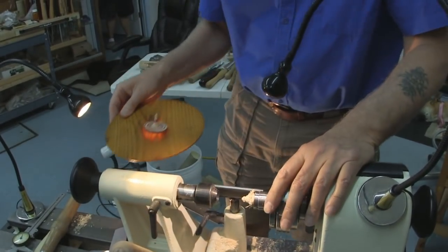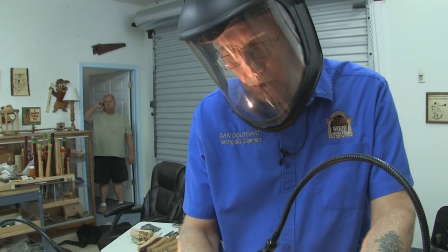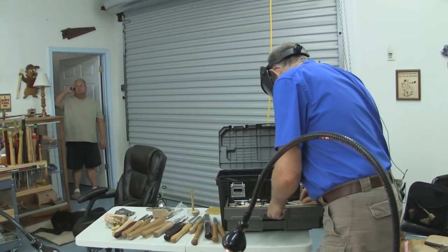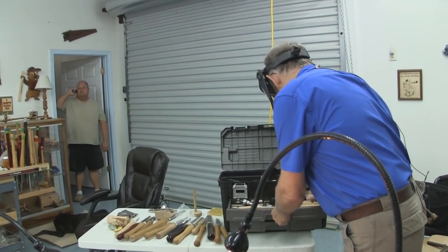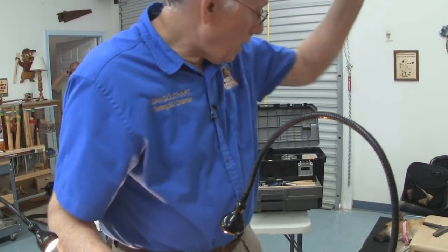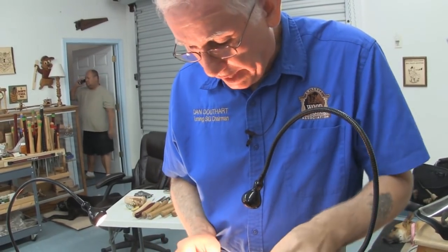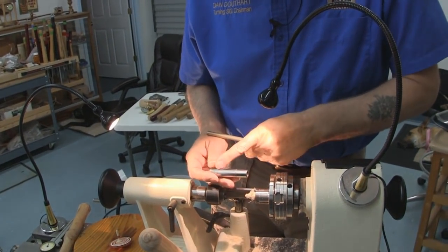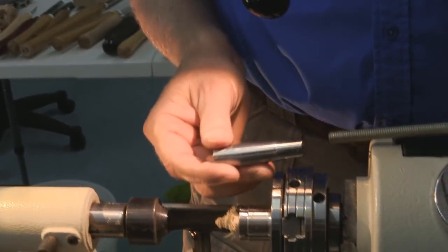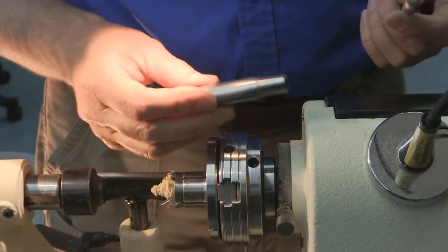And the jaws I'm using here, I skipped over it, these are the pin jaws. You can also use a thing called a collet, just like the collet in your router. You can get collets in different sizes. This one has a half inch hole in it. It's got a number two Morse taper on there. It's threaded here, so I can put the drawbar in. It just goes right into the Morse taper.